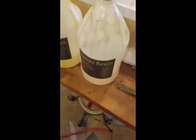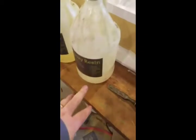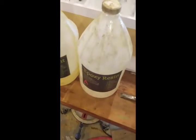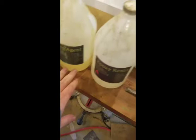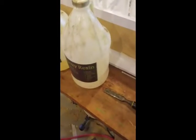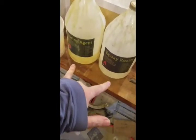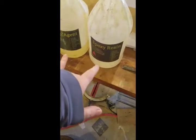There's always a lot of questions about epoxy. This is just regular bar top casting epoxy. This is the curing agent or hardener, and this is the resin, sometimes called filler. This is also identical to boat repair epoxy. Some of them are UV resistant — I don't care about that because this is going to be indoors in my shop. This has a 15,000 PSI compression strength and a 7,500 PSI tensile strength. It does cure very hard and makes a nice cast. This is $90 for a two-gallon kit of resin and hardener on eBay, and I've got plenty to do this casting.